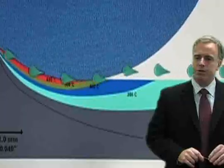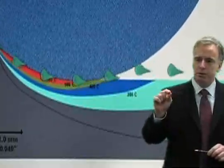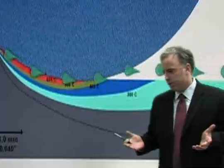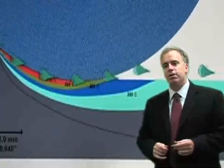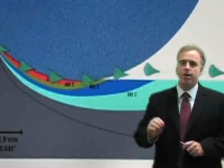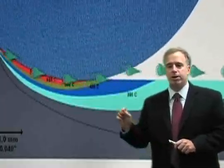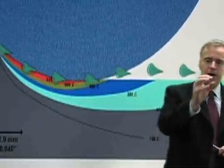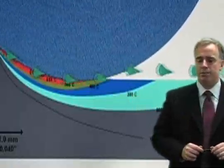Now, if we're going to do that, we've got to get coolant within those little pores of the wheel. The wheel's spinning at, let's say, 40 meters a second — 8,000 surface feet a minute. So our coolant has to be going at 40 meters per second or 8,000 surface feet a minute to penetrate the air barrier, get within the pores of the wheel, and allow that wheel to carry it to the hot spot.